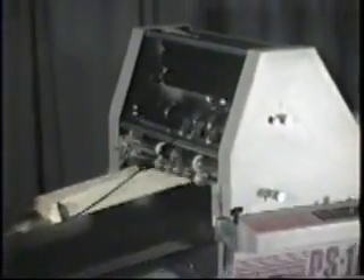A convex head enables you to put numbers on the sheet vertically. All total, you can put up to 12 numbering heads on the PS10 — and possibly more depending on your specific application. With 12 heads at 10,000 sheets per hour, your production rate is 120,000 impressions per hour.